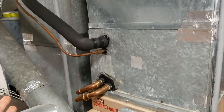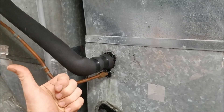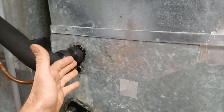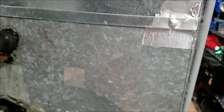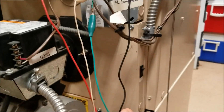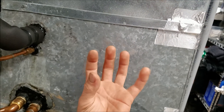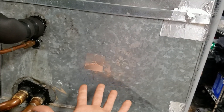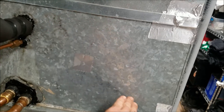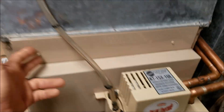During hot humid summer days when you turn your AC on, two things happen. The compressor turns on outside, Freon comes in, and there's an evaporator core inside that gets very very cold. At the same time your blower fan is triggered on — 24 volts is sent down to the solenoid and that turns on your fan. As it's running, just like a cold coke can sweats sitting out in the room, this very cold evaporator core sweats, and that water is drained down these tubes over to a sink.